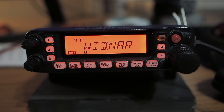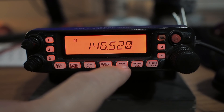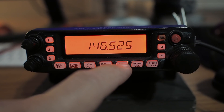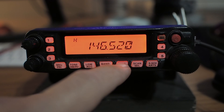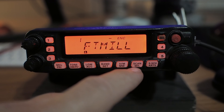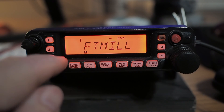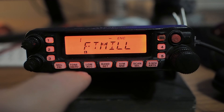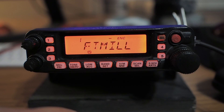The other key for understanding this radio is knowing what this button does — it shifts between memory and a home channel, which is just your favorite frequency. Honestly, I wish they wouldn't bother with it, because as soon as you turn the tuning dial you're in basic VFO mode anyway. So basically it's switching between VFO and memory mode. That's pretty much the lay of the land on this rig. Now you know the difference between tapping and pressing buttons, how to switch between VFO and memory mode, where the power button is, and how to switch between high and low power settings. Hopefully that'll get you started.